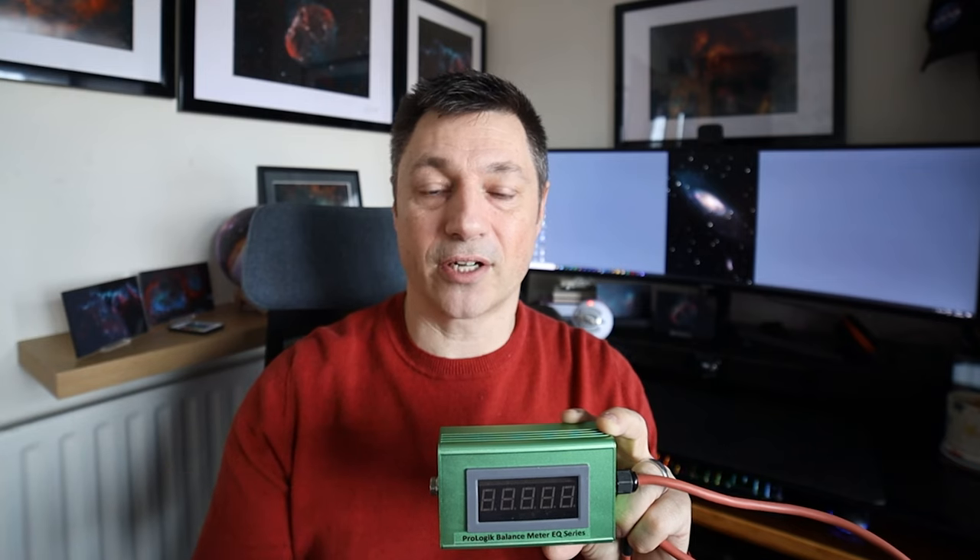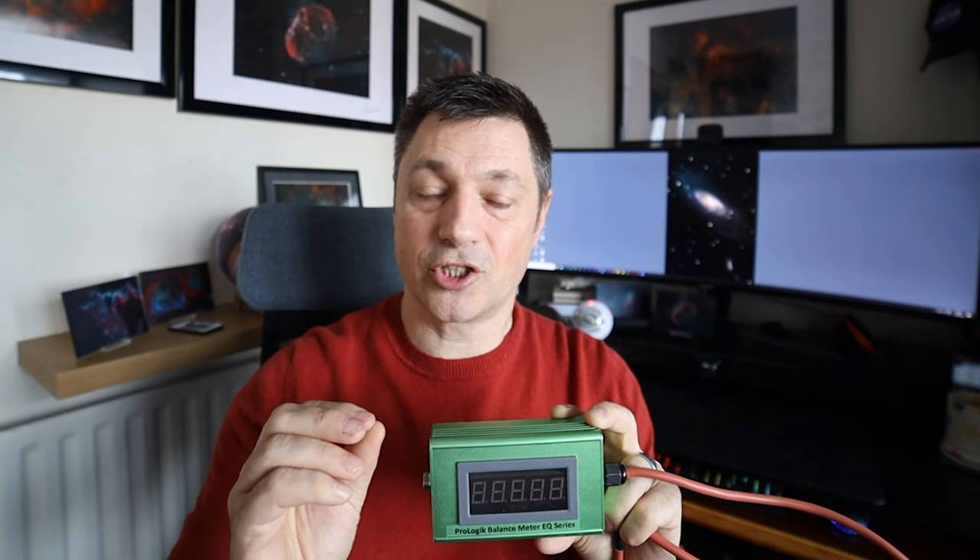It will also help you detect whether you've got any fine binding in your gears between your worm drive and your worm gears. If like me you're someone who's done adjustments to the backlash or the worm carriers, or done a full strip down and rebuild and hyper tuned your mount, this tool is really useful - because very fine binding can actually show as backlash on the graph if you do a guide assist in PHD2. My name's Glenn, you're watching AstroBloke.